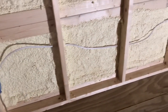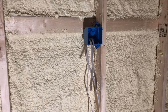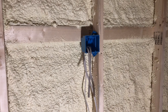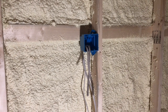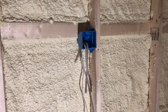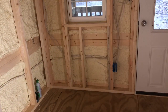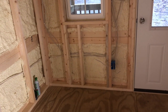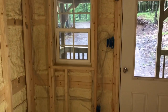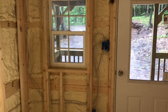The wiring is going to continue on and go up to feed that electrical box for the wall-hung TV. You'll notice two wires coming out of that box — we're going to tie those in by a pigtail again. Then the power is going to continue down to feed this outlet in the dark corner of the cabin, and also go up to a box that will operate some lights and a possible future ceiling fan.